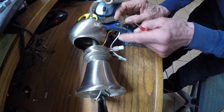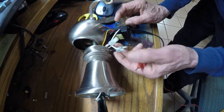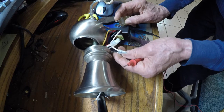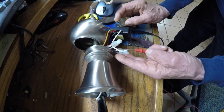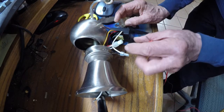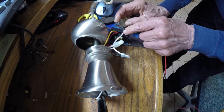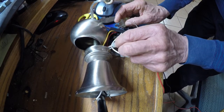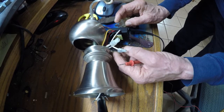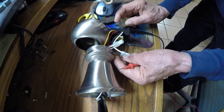To summarize: the red wire is neutral, and the black wire is the incoming power from the touch module. The black goes in, and then the yellow wire goes back to ground. Red from this box goes to the white wire; black from this box goes to black. Some of these lamps use completely different colors — brown, blue, who knows — so you really have to be careful.